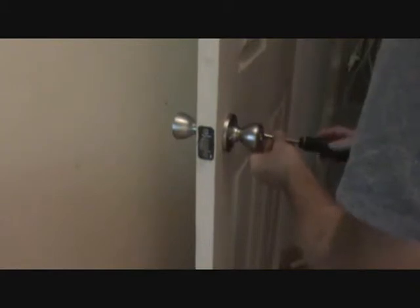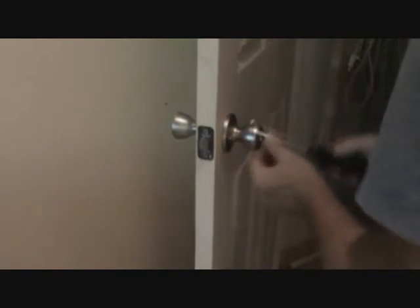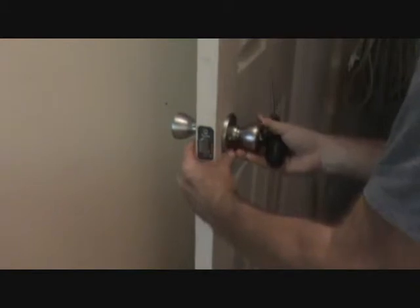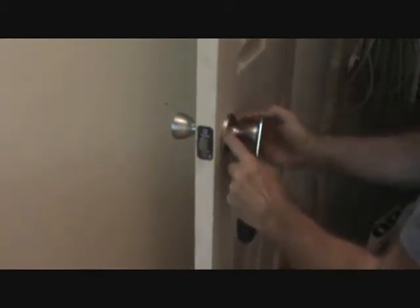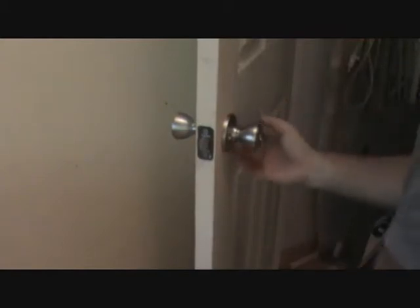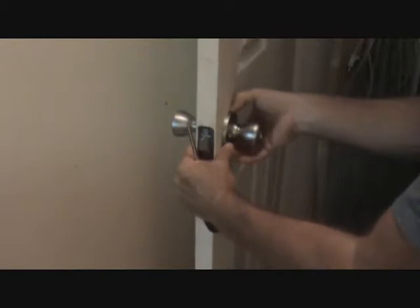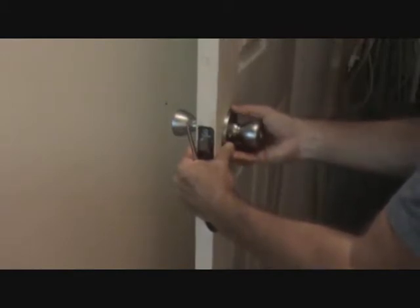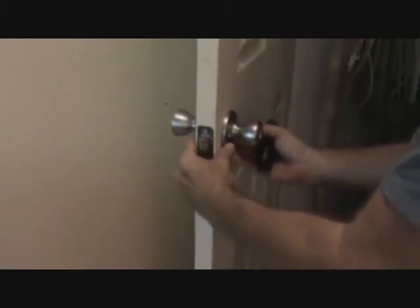Okay. Now I can hold my foot on the door and my knee on the door so it doesn't go anywhere. Okay, now before I get it tight, I just want to kind of look at that. Because see, I can swivel this a little bit. I don't want it up too high, I don't want it down too low, and especially if you've already taken an old one off and if your door has already been painted, you might have an escutcheon trim line that had been etched into your door. You might think, well, it needs to go right about here, because Joe said center this, but my escutcheon edge is just barely showing, so I need to lift it up just a little bit or down just a little bit. Okay. So I'm going to just split the difference.